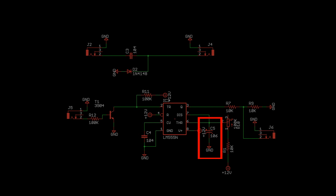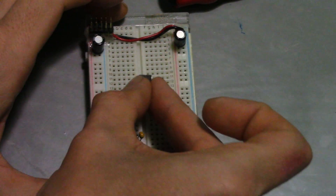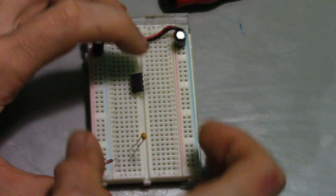The larger the capacitor, the longer the output can last. These two resistors on the output limit the voltage in case you're interacting with modules that expect to see a gate input closer to the 5 volt range. Start breadboarding by placing the 555 chip on the breadboard.